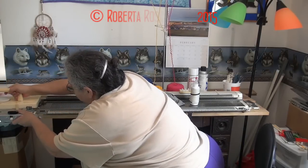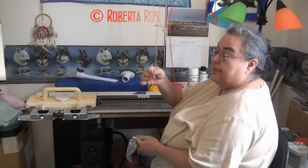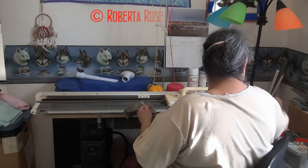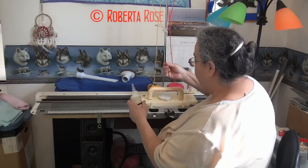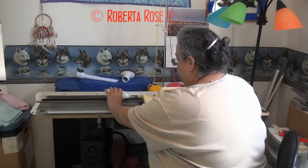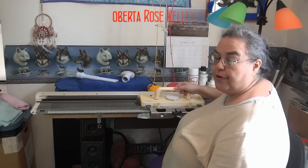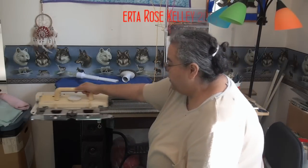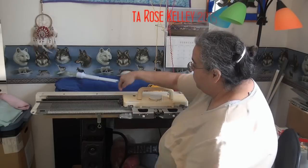One of the other things I will do — here's one where I did the brass railing on the underside of the carriage — is I will take this oil and very carefully put one little drop on the back rail, one little drop on the front part where the carriage rides, and then go back and forth. I can feel it getting easier already, just by that — even though I already oiled the underside of the carriage and the brass part, this little added amount there will help.